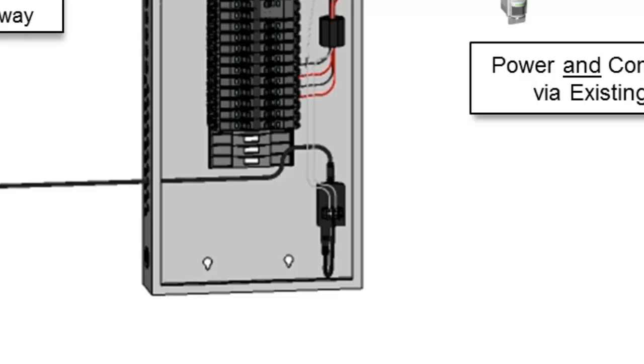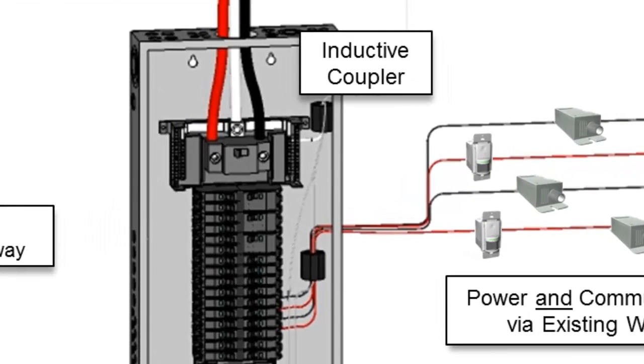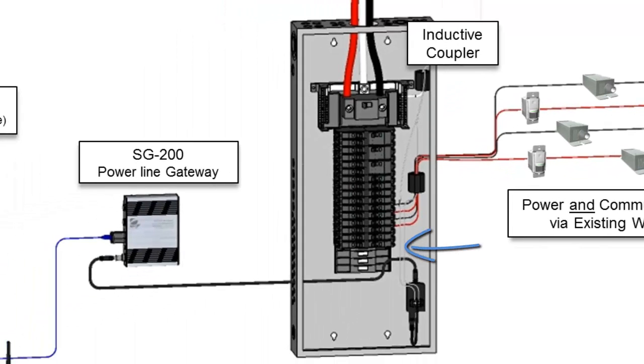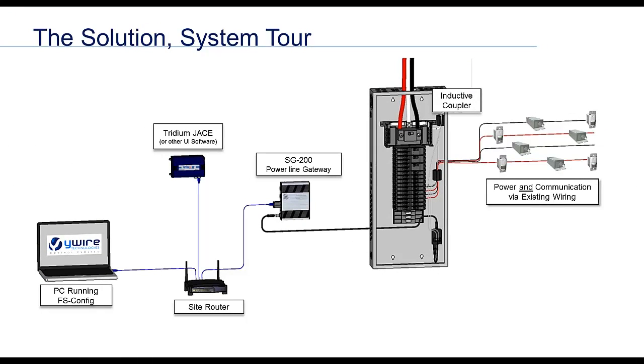How this works is we place ferromagnetic couplers, also known as ferrites, around the load side of the breakers for the circuits we want to induce a network on. We then place a ferrite around any neutral that is connected to the neutral bus. As illustrated, we then run a stranded single conductor out of our coax connector through the ferrites and back again. Once this is complete, we run the CAT5 cable from the gateway to the site router. The site router is an off-the-shelf device available from any electronics retailer. When the site router is connected, it sees a network of MAC addresses and assigns IP addresses to create a usable IP network. At this point, we would make these addresses static and the network is complete.